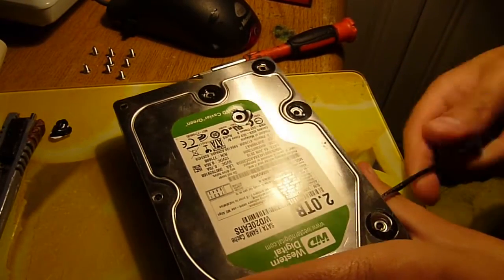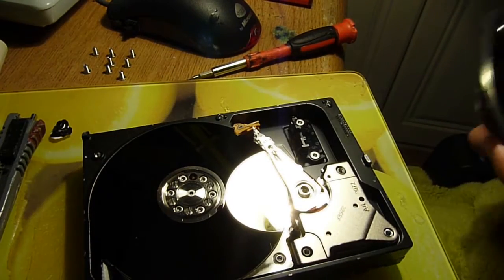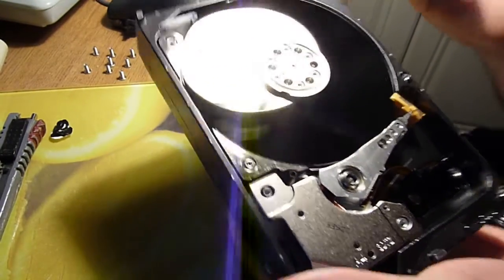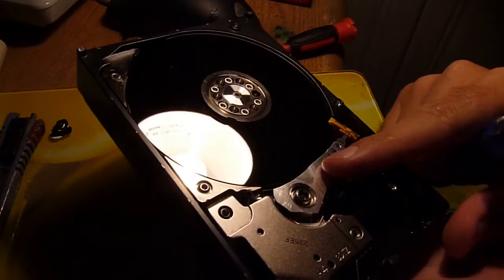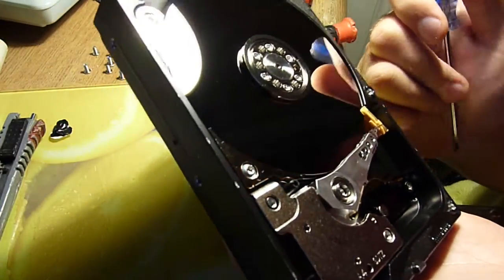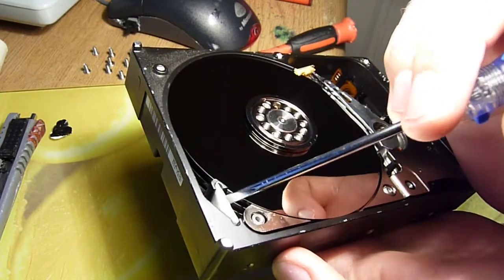Now, the gasket's still down quite well. And we have three platters. It's pretty much as you would expect. Looks like a hard drive from 1996, except it has this nice parking mechanism, because older hard drives tend to park their heads actually on the platter. Newer ones have these lovely parking mechanisms, which basically mean it cannot head crash. We can demonstrate it — we can see we have a three platter design.